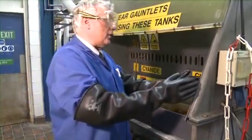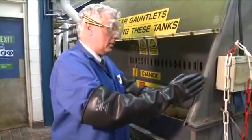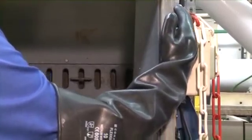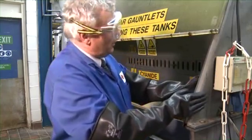We also fitted another baffle exactly the same as the left hand one on the right hand side, which again went all the way around the back to reduce the eddy currents and hence the spillage that may occur at the edge of the cabinet. My advice to anybody who has problems with enclosures is to get competent technical advice and then modify them where possible to meet the legislation such as COSHH, and also at the same time to think clearly about how you're using the process and whether you could substitute it or do it in a different way to reduce the risk.